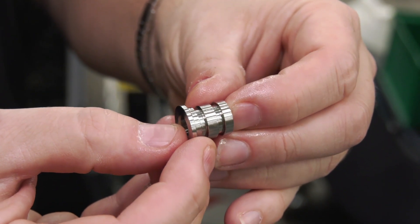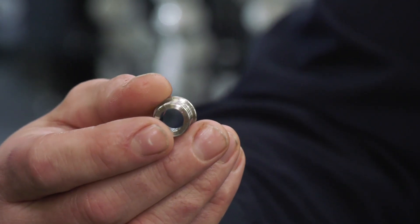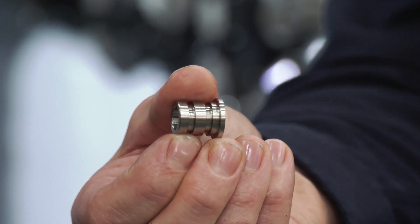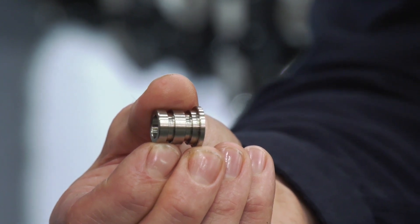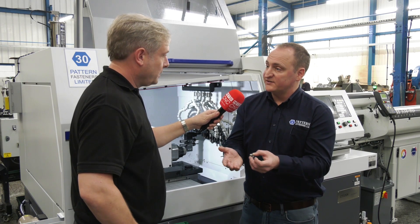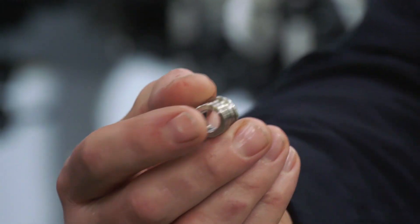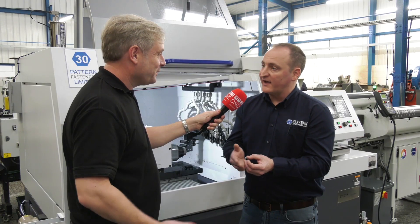Yeah so this part is stainless steel 316, it's not 32mm but the machine's very good for it - bit of turning, bit of grooving, some drilling work, we're doing reaming as well to hold a tight tolerance on the bore. And the machine's very quick at doing the job too, so that makes it a good machine for the job really. Not really a complex part but the tolerances down the bore for example? Yeah very tight, so you need a machine that's very well aligned and we've got that here.